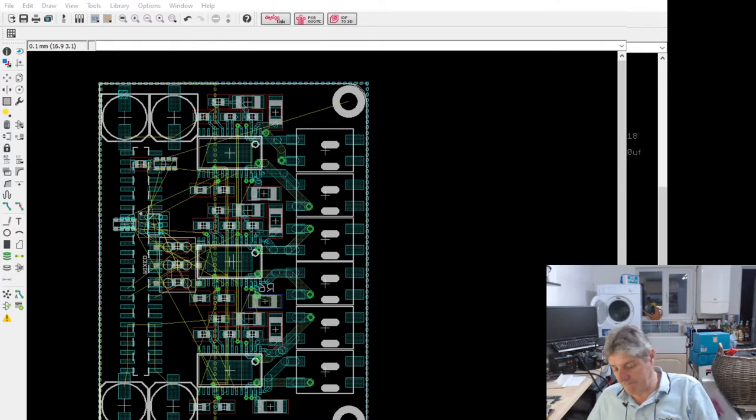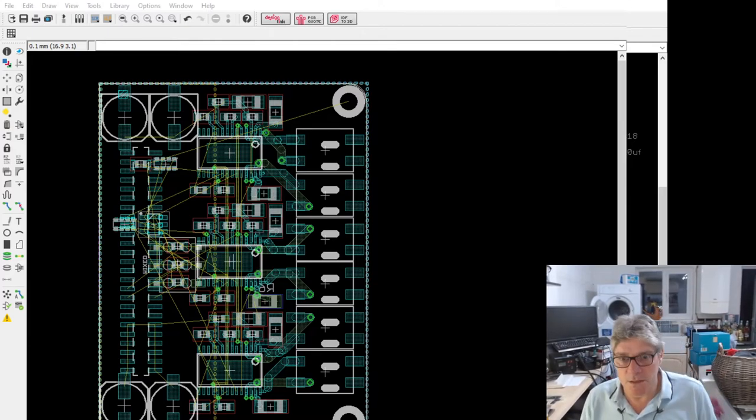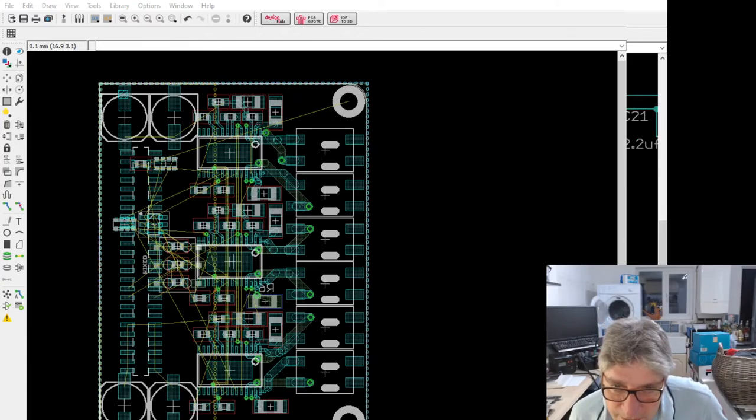what do they call it? So if the motor doesn't move properly, the current sensitivity on it is good enough to detect a stall on the motor, and it can signal that via the diag. So the diag signal on each stepper driver can send a high level, but because they're going to be sharing that pin, I would then in turn have to query them all using the half duplex UART to find out which one kicked off. In fact, it may have been more than one, if the axis is stuck somewhere, got caught on something, for example. So I think one of those should definitely be a diag.